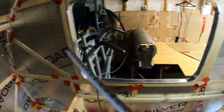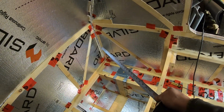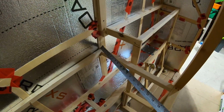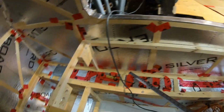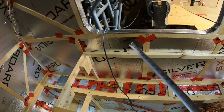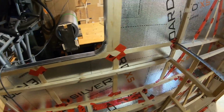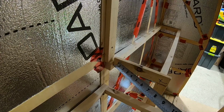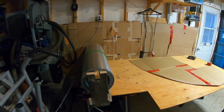Now it's aluminum time. I'm going to attempt to cut a piece of that. So I did a quick measurement, and from here all the way to here, because that's where the bend going across will be, it's 80 3/4 inches. I measured it in 3 places: right down here at the base, about halfway, and right into this corner right there. So it's 80 3/4 inches, and I'm going to come out from there about 2 inches overlap. Well, that might be a little much, maybe 1.5 inches, so that the other piece of aluminum can butt into it. And I'm going to roll that out, mark it, and cut it.